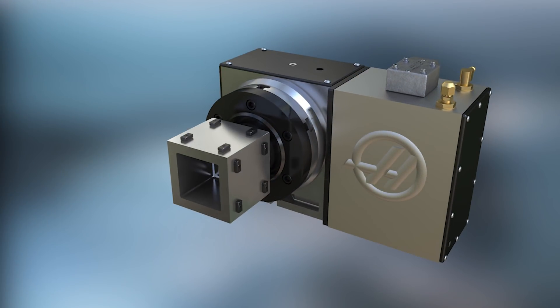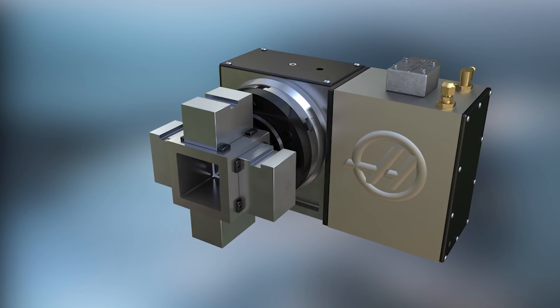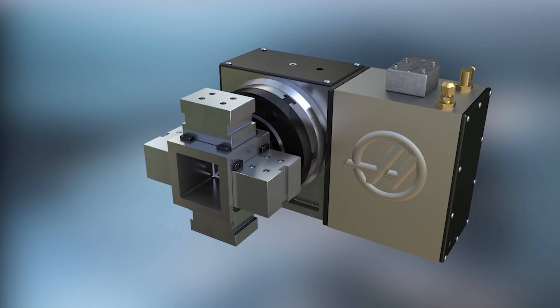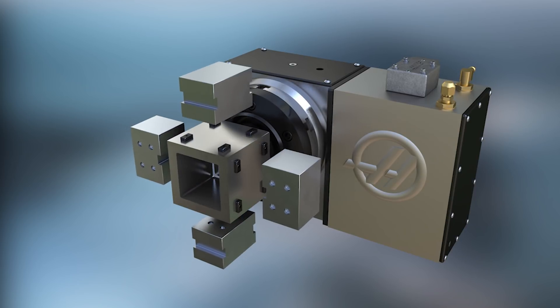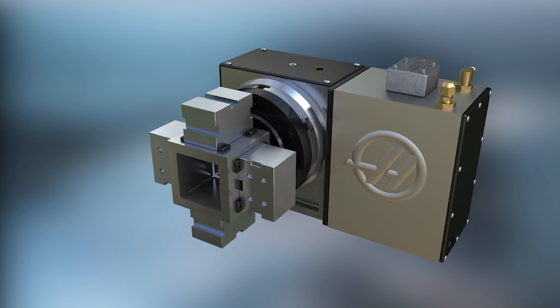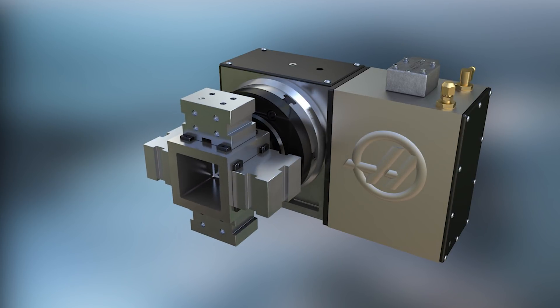The cube gives you four sides to mount smaller parts. Add low profile clamps and you're ready to go. Machine all six faces of each part with a flip in the middle — flip and rotate your parts, index the rotary. Now you've swapped your OP1 and OP2 positions to finish adding all those features.